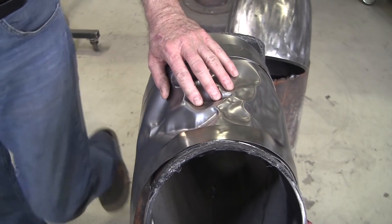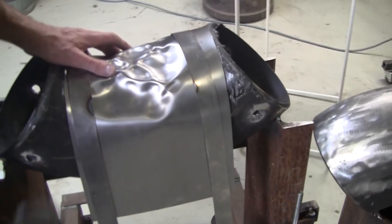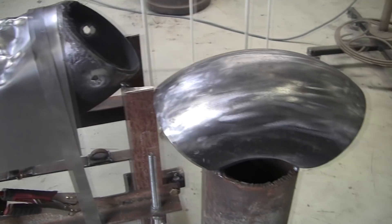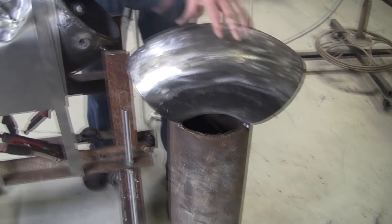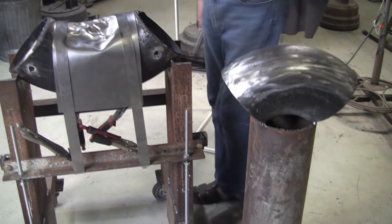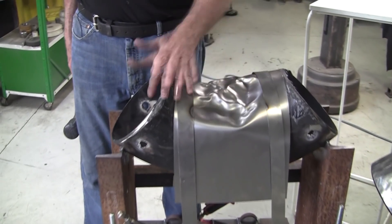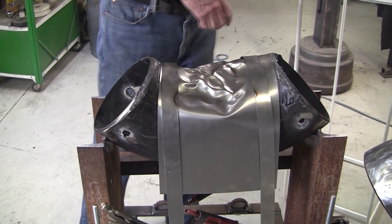You can't get this in one go — you're going to have to hit it, make it all confused. I call it confused — like that, partially shrunk. These ridges I call spines, same as if you're doing an edge shrink, it's the exact same thing. We also made another tool that's the reverse, which will allow us to planish this out really easily. To get the full reverse shrinkage with no stretching on the edge at all, it'll probably take about two or three goes on this tool.